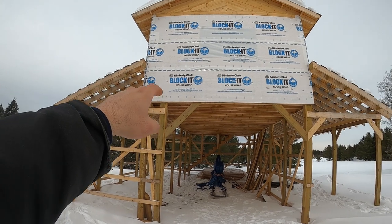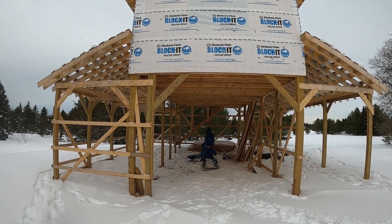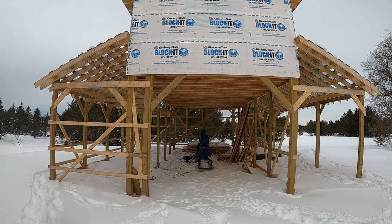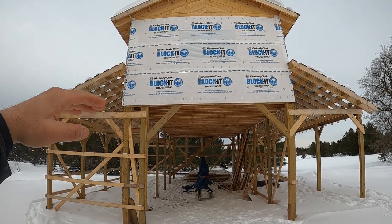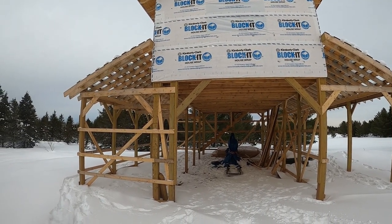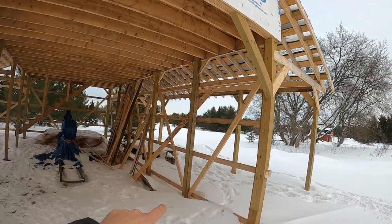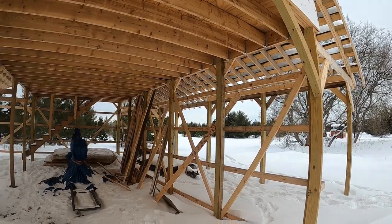Height-wise, I built this thing to 10 feet to the bottom of the floor up there, and that's way too tall. My tractor could have fit in it with an 8-foot ceiling. Everyone tells you to build it bigger in case you get a bigger tractor, but I think I'd have been way better dropping it down even to 9 feet. It adds stability to the build. Once I put in the cross braces in that V-shape, you can go up there and do a little jig and the building doesn't move at all.